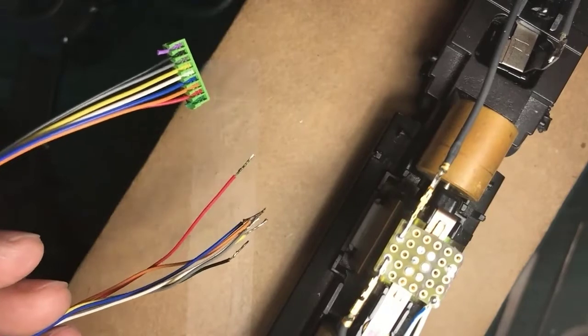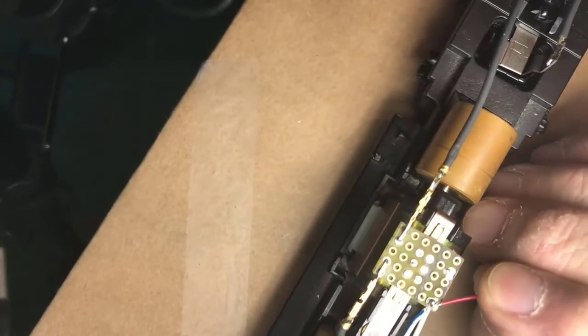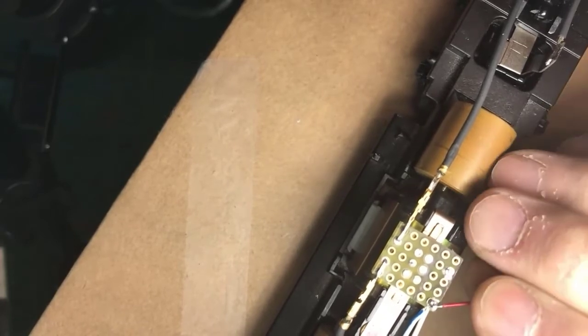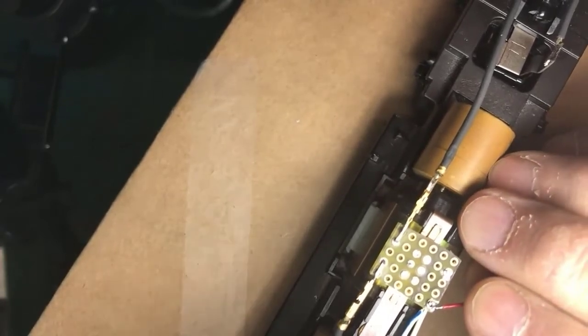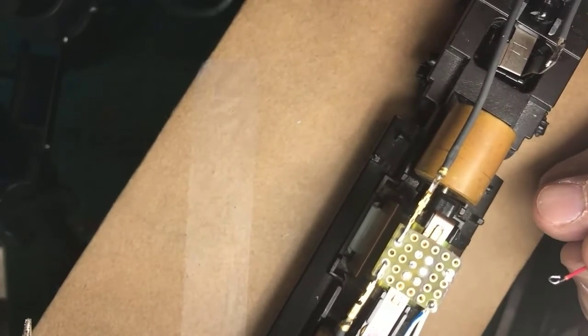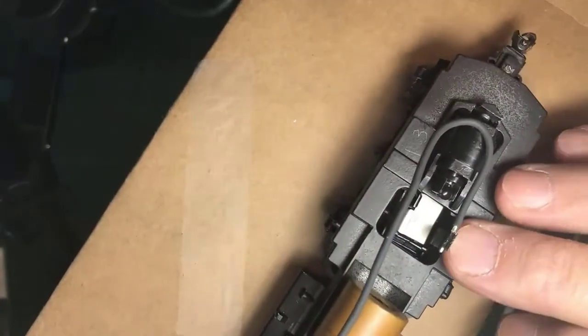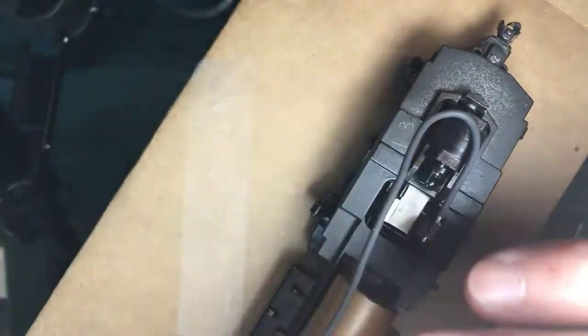to these points. Per the standard, the red wire on the DCC is the right rail, if memory serves. And lo and behold, I didn't cut these wires down. They're sticking up enough that I can take that wrap of red wire, which is the right-hand rail. Okay, where's the front? Okay, there's the front. This is the right-hand rail over here.